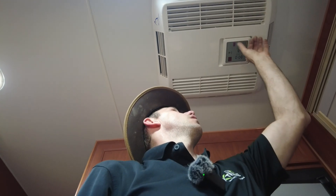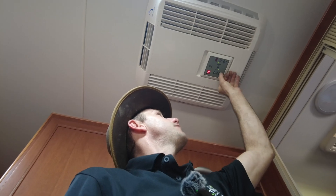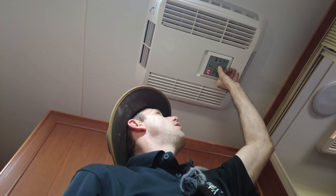It's getting warm in here. Let's put this roof clunker on and crank it right down. Fan on high, temperature to 16. You should hear this clunker kick in. Hear that? That little surge — that's the inrush current. For those who don't know, the Victron is a low-frequency inverter. It has a massive single transformer able to run those big inductive loads like you just heard — the roof clunker kicking in. It won't damage it. It can support that and surge up to like 6,000 watts.